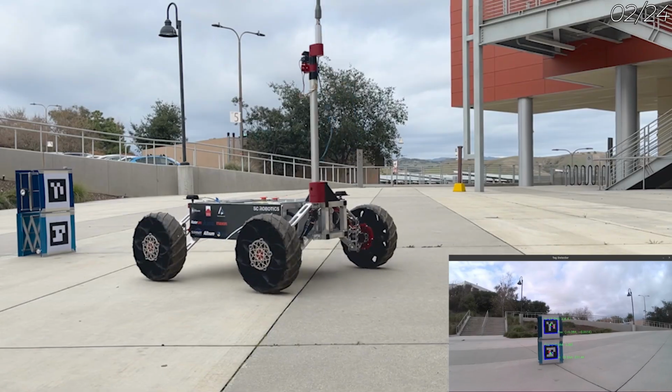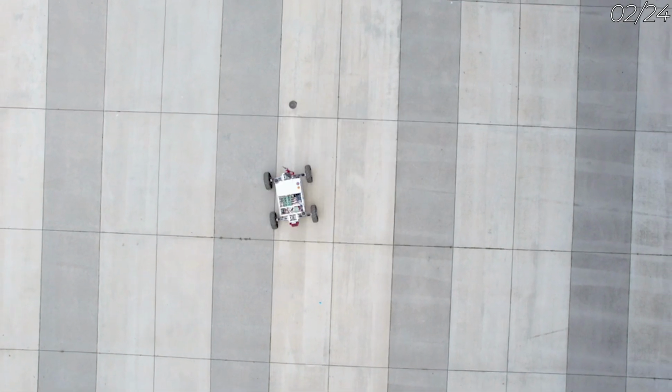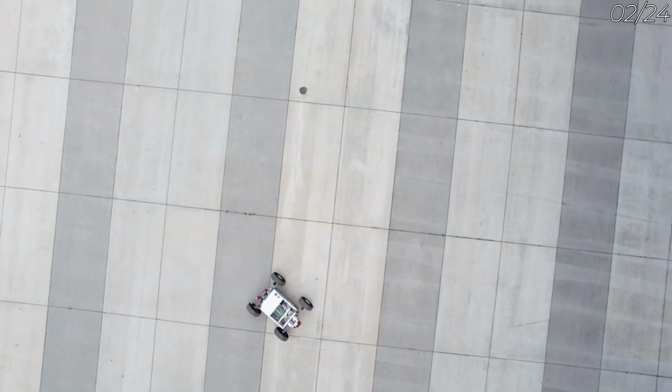If commanded to search for an object or tag, the rover will perform a spiral search upon arrival at its target GNSS waypoint. The rover then sets a new waypoint near a detected object's position and on arrival notifies the operators.